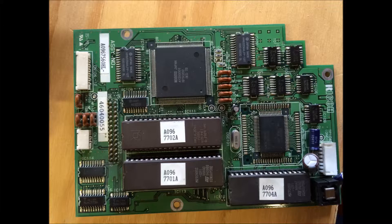And then the three socketed chips, starting from the top left, are all EPROMs. The first one is an AM27C2048 — a 2 megabit CMOS EPROM. The one right below that is an M27C4002, a 4 megabit UV EPROM. And on the right side is an M27C1001, a 1 megabit UV EPROM.